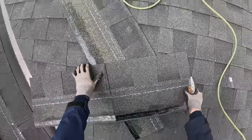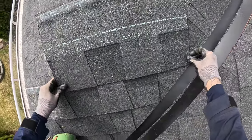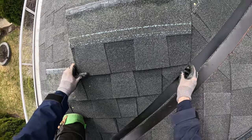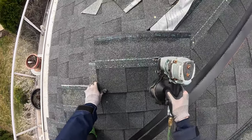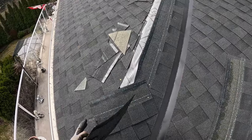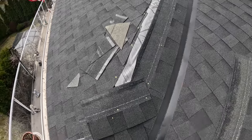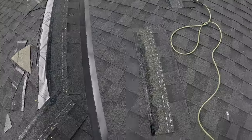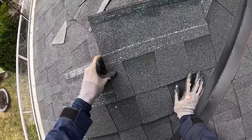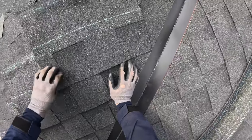This is just another little tip. Not every section is this small — this is a pretty easy spot to catch. But if you get a section that's quite a bit bigger, it becomes more problematic. When you put two shingles on, all your keyways are never going to line up because they're all twisting. This way you can kind of cheat it a little from your existing roof.